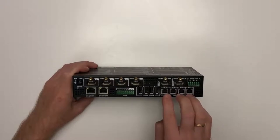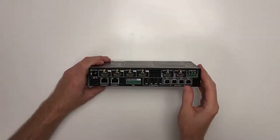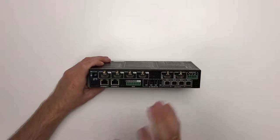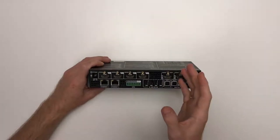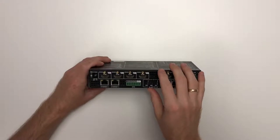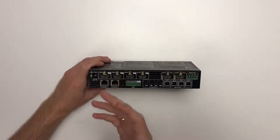Finally there are four USB 2.0 Type-B connectors for the host devices. Regarding connection steps, you can connect the cables in any order as long as the devices are not powered — connect everything first, then apply power to the entire system to avoid harmful voltages. For the power-up sequence, it is recommended to start at the display side and work backwards to the source side, because some sources only read out the EDID when they are powering up, and if the source boots faster than the downstream device it may need to be restarted to read the EDID again.